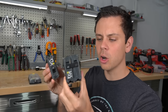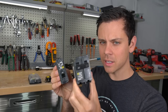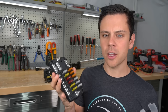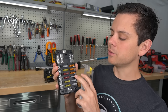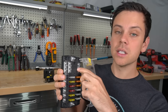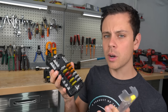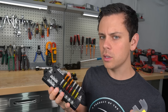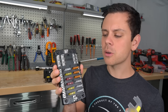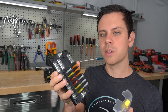Also realize that home circuit breakers are AC rated only — do not use these as a disconnect for a large battery. Fuse boxes should be high quality as well. This one is for low voltage DC like a 12 volt system and is made by Blue Sea Systems. This is a fantastic fuse box because there are lots of low quality ones on Amazon that I would never trust. Spend the extra money and get a marine grade Blue Sea Systems fuse box or something equivalent.